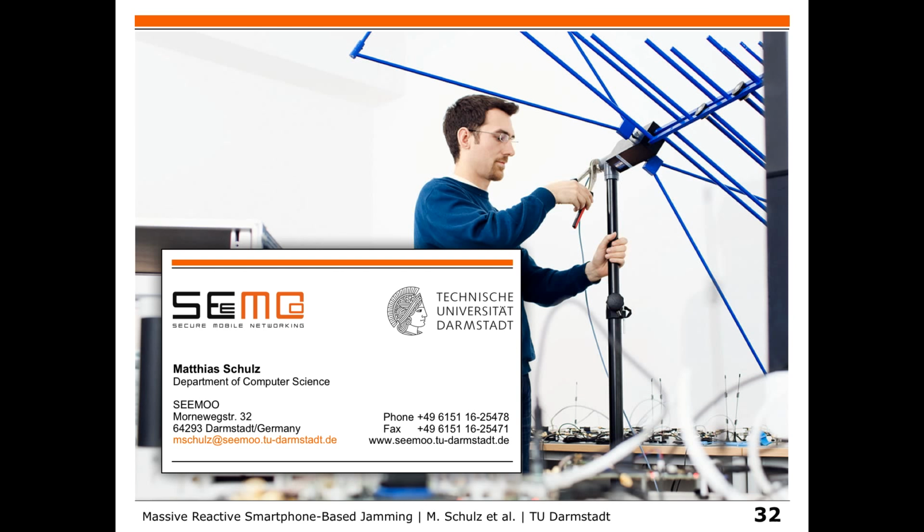Yeah, and even adaptive control might also prevent you because it's difficult to estimate what is the correct power, because you need to estimate it on the receiver side. And of course, your channel to receiver as a jammer is different from the sender to receiver. That is true, but therefore we have this adaptive power control jammer that is actually checking for acknowledgements coming from the intended receiver. So if no acknowledgements are coming from the receiver, you can assume, as long as it will always send an acknowledgement, that the frames are either correctly received or not. So sometimes it's difficult to interpret the loss, right? It can be. Yeah. Anyway, we can take it offline.